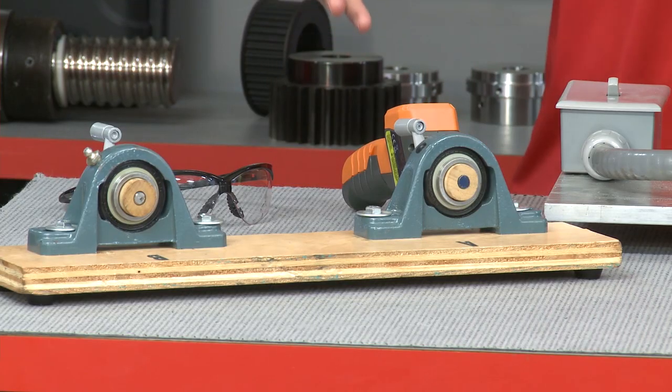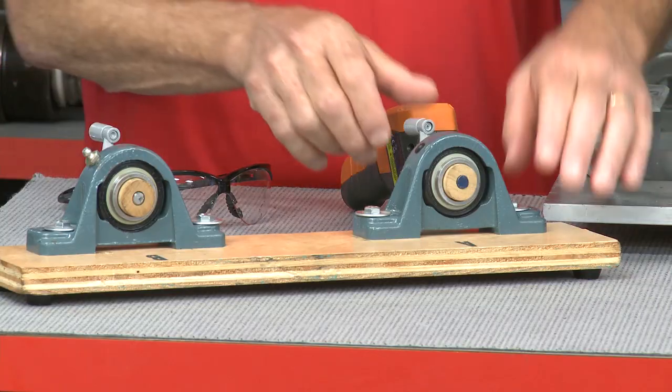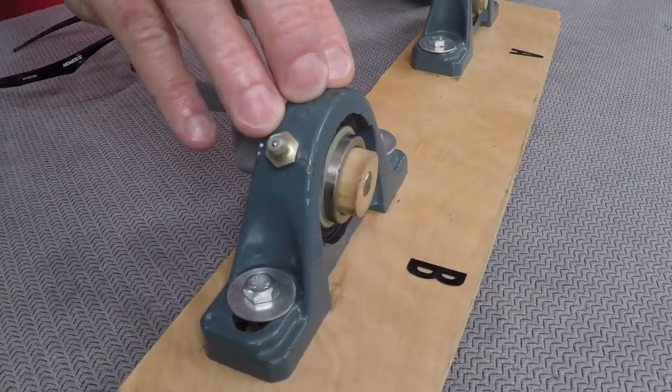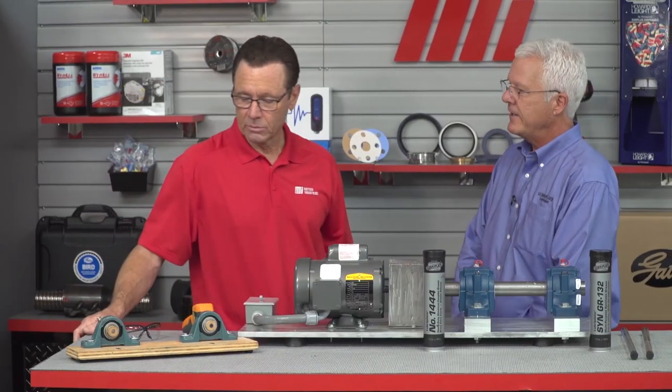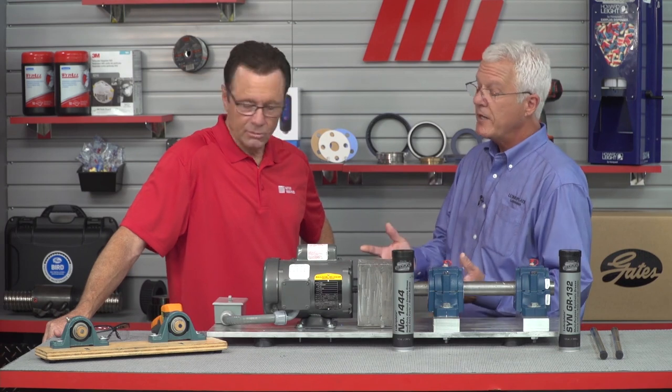Now we have another demo over here — it looks like the old cranks on jalousie windows. Turn each crank and let us know what you think. One is kind of easy, the other is harder — that harder one has the 1444 in it. At slow speeds that's not an issue, and that heavy base fluid in the 1444 helps it resist washing out of those wet bearings. But crank up the speeds and you'll get high operating temperatures you want to avoid. The same thing happens when you overfill high-speed bearings. For slow-speed bearings, especially in wet environments, keep the bearings full. But for high speeds, fill them 30% or less to keep resistance down on those fast-moving rollers.